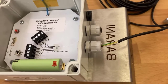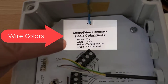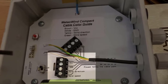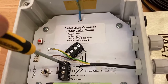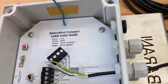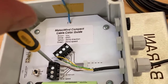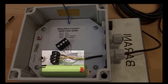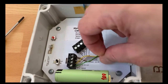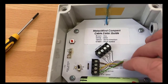We will pull the wires through the cable gland, and then we will use the guide here to screw the wires into the wire terminal using the flathead screwdriver. The VCC wire is the brown one. We will take the VCC wire, the brown one, and stick it into the wire terminal, then proceed to tighten it. We will repeat this for all the rest of the wires. Once the wires have been screwed into the proper wire terminal, just place the rest of the cable in the cable guide so that everything is nice and tidy. You can push them through using your hand.